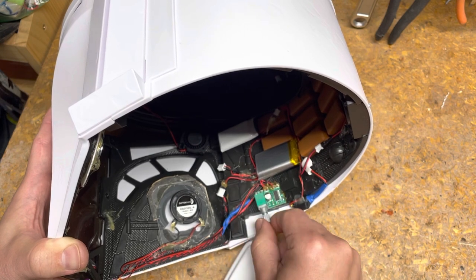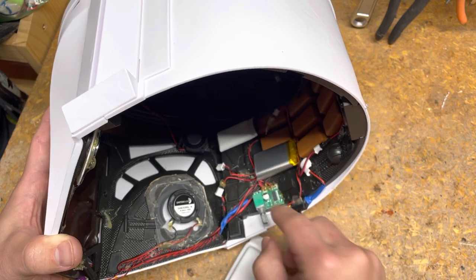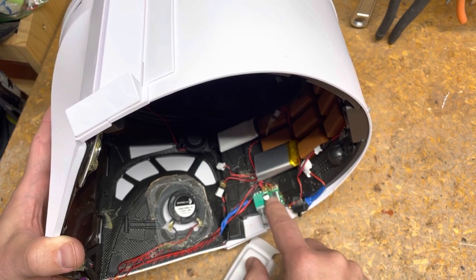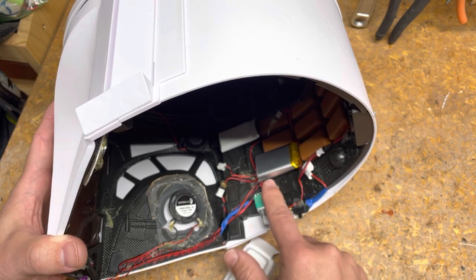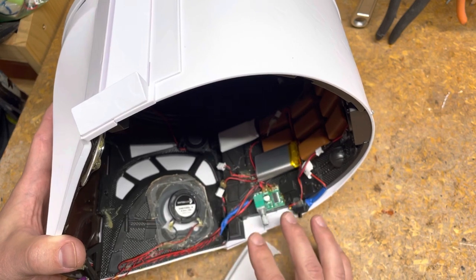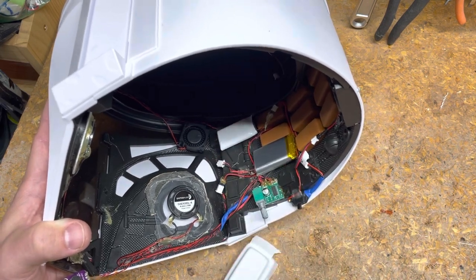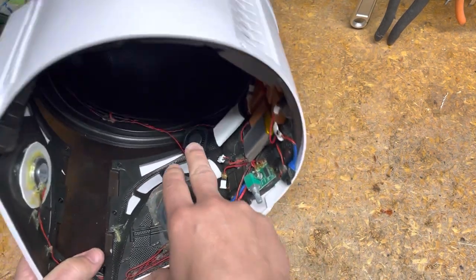This is the audio volume switch. Originally I was stealing power from the amp board to run the fans, which kind of worked, but it wasn't best practice — the fans ran slower and it produced a hum that fed noise into the amp. On top of that it was only 3.7 volts powering 5 volt fans, so I made a separate power supply for the fans.